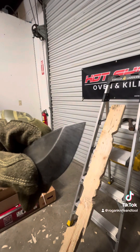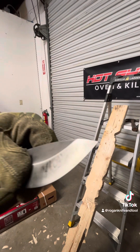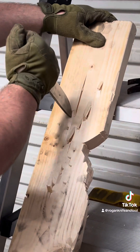This is due to two reasons. One, we use a chisel grind, which is inherently strong on a tip. We also do all of our heat treating in-house with hot shot ovens. This gives us very consistent results all the time, and we also test at every batch.